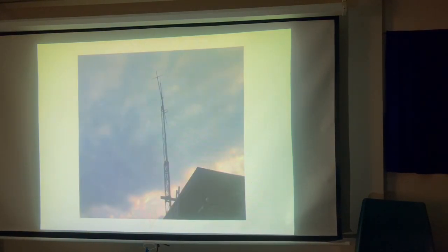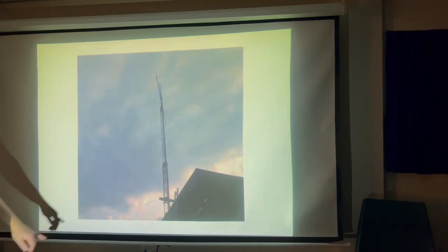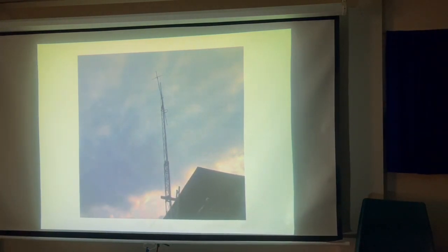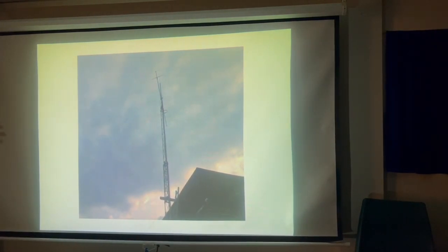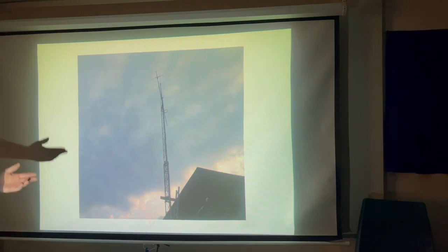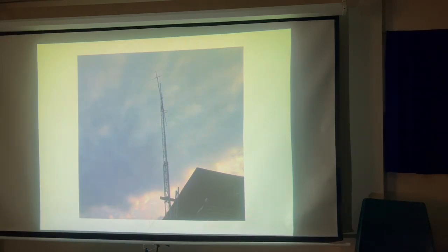There's another shot of the antenna. This is our safety device. This is a block of wood. That's the safety device for the mast. Because the mast should have a catcher plate on it to stop the inner mast falling down if the cable goes, but it doesn't. So I use a block of wood. It's just as safe in my mind, it's fine. I should put a catcher plate on it, really.